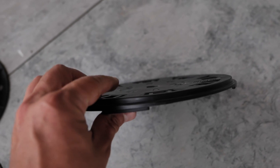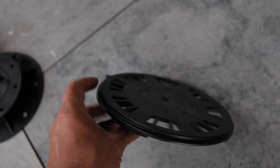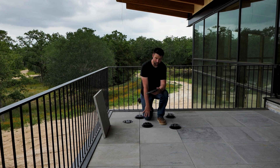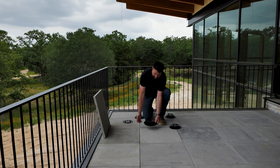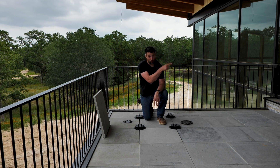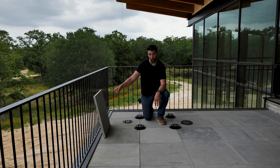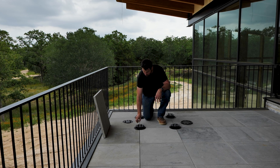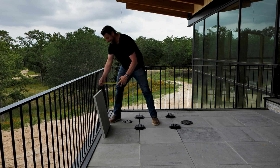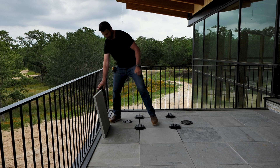They also make these really cool angle adapters. Because we're on this angle, we want the pedestals to be flat. This is a two-degree adapter — it gives us a two-degree angle on the shim. I can stack these two, four, six, eight degrees to match the slope of my roof as it falls, making sure that my Bisons are sitting completely flat. The stone we use is out of the same quarry as the wall stone — they dug it up and sawed it into tiles. This is the inch-thick version, so we're at about an inch and a quarter for this tile.